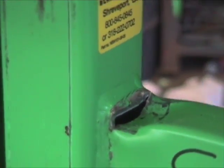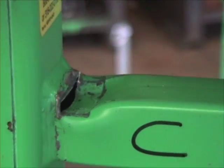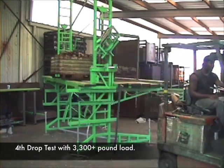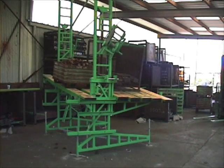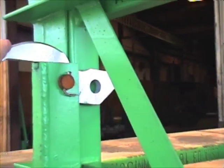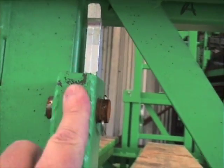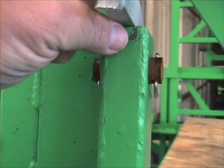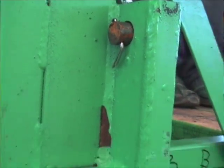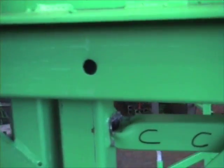The weld has held — it's the base metal that has given way. We're going to see if maybe it'll hold for drop number 4. I'm guessing that it will. Okay, Jay, go ahead. The safety catch functions within its case as it should. There's a little flaking of the paint where the pounding of the catch has deformed the top piece of metal just slightly. There are no cracks in the welds. Everything has worked beautifully.